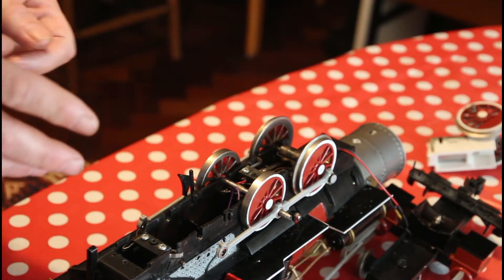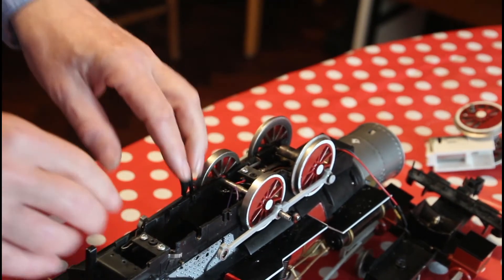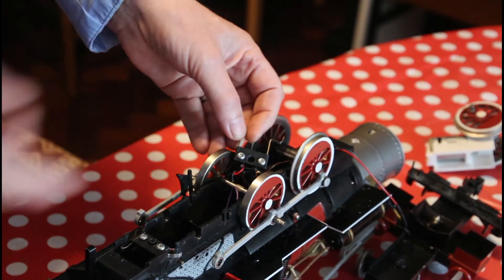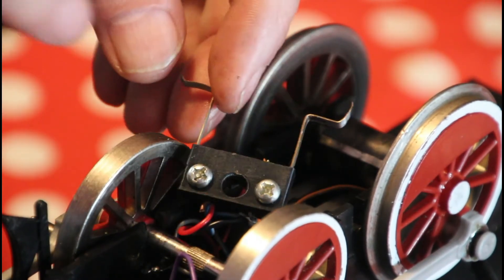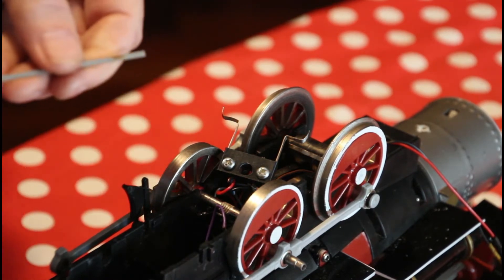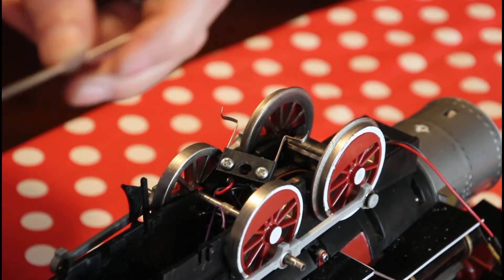So I've now got pickup from the front bogie, but how do I get pickups from these wheels? The plungers are terribly difficult to get at, so I decided to make my own pickups. These pickups are made from a little bent bit of spring steel — this is the metal reinforcing strip from a car windscreen wiper blade. It's nice and springy and it's about the right section to act as a wiper.